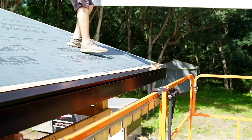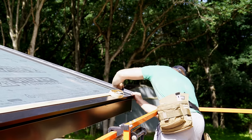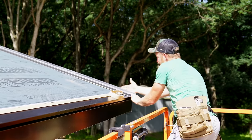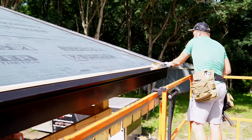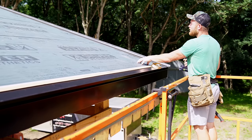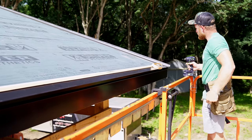Alright, so we've got our first sheet going up and you'll notice we've got the double bead mastic tape. I'm going to go ahead and push this up tight into this eave trim that we installed earlier, and I'm going to make sure that this one inch bend on my end is in line with the edge of my roof - which looks really good. Now, very important that you are square to start off. We already know we're square because we squared our roof when we sheathed it.